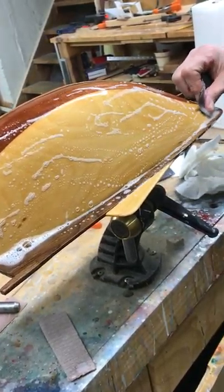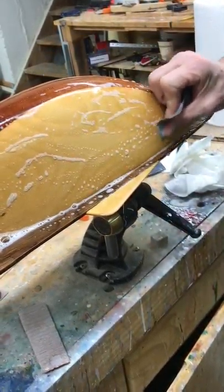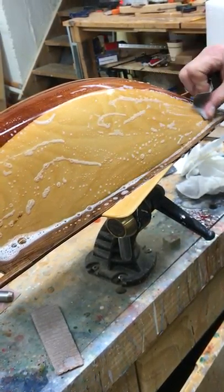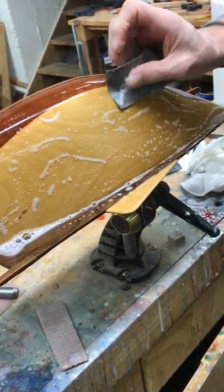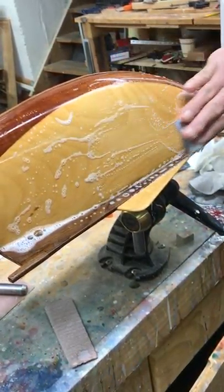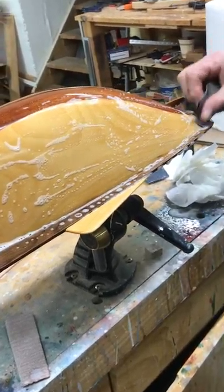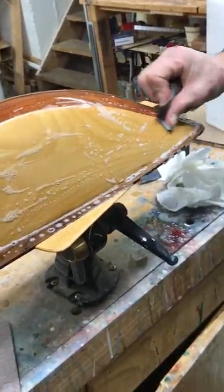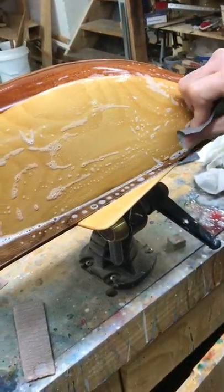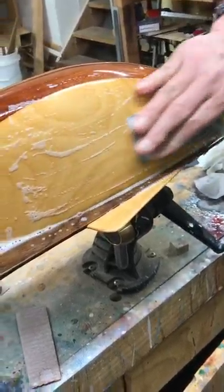If you're painting a model, I do the same thing. I wet sand the paint so it's absolutely smooth, and quite often I cut through and then I have to put on more coats. It's easier to tell if you cut through with a painted finish, but when you dry it, you'd be able to see if you cut through pretty clearly, right, with the varnish? Yep. It's a lot lighter in color if you cut through.